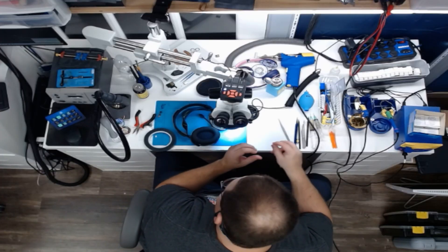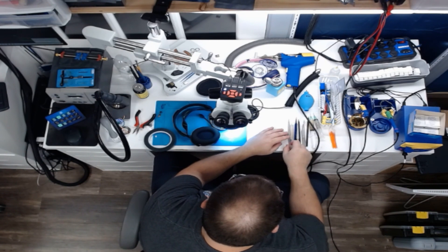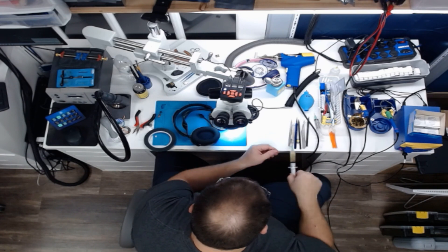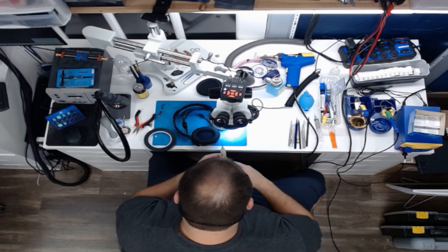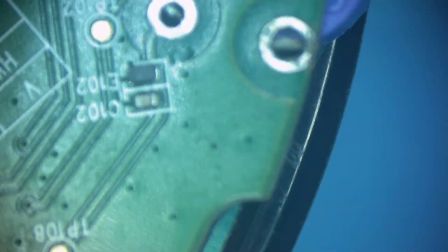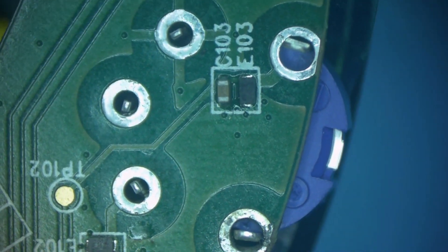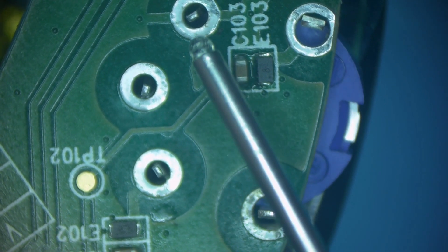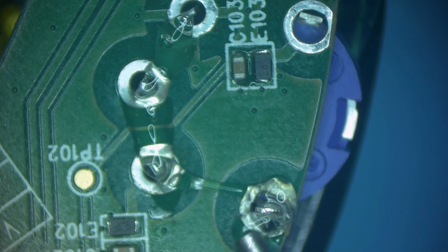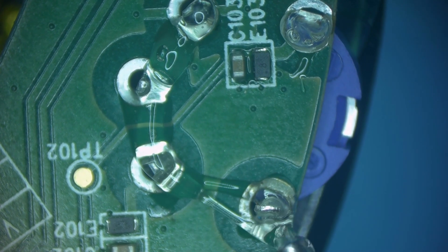I just put a little piece of tape on it to hold it in place while I work on it. Now let's get started. I've got my solder here — I can just sit it out on the table somewhere where I can touch it. And then I'm going to get some flux — some ChipQuick here. We're going to start adding the flux. I don't like to add too much; I'm just going to add a little here on each one to help with the flow.